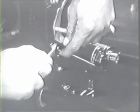At this point, you can safety the oil screen to a gear case cover stud. However, do not safety the oil pressure relief valve cap at this time, as a final adjustment will be made when you run in the engine.